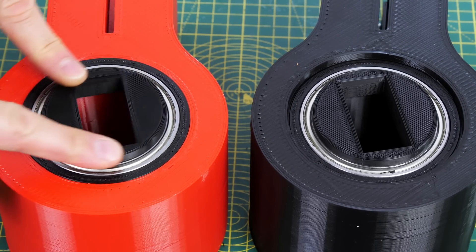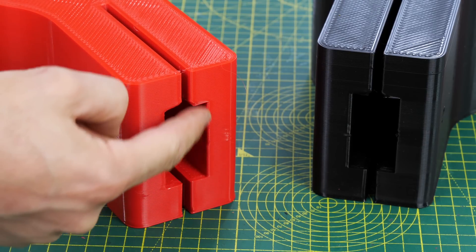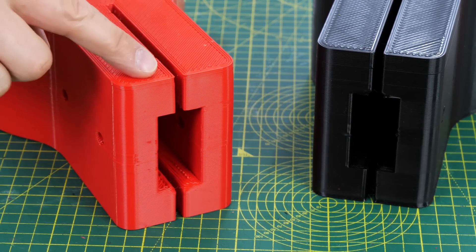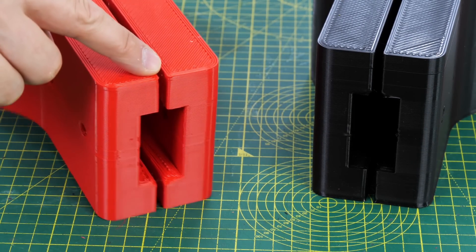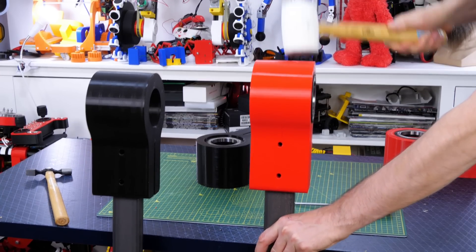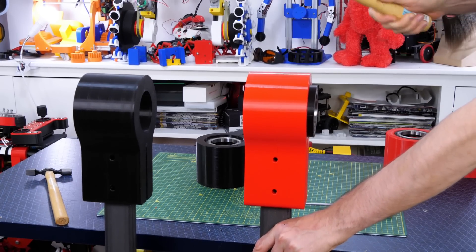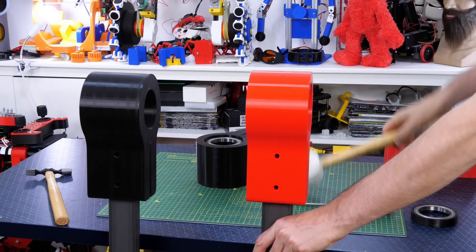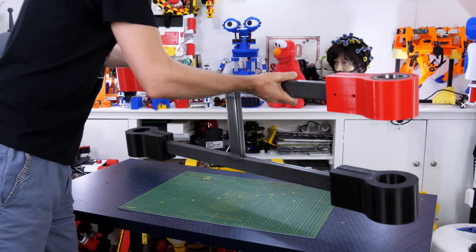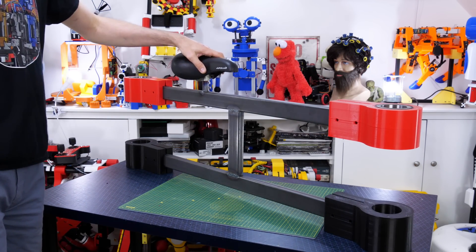In there we've got some inserts for my 50x25 steel so I can put a square axle in essentially, and we've also got the square axle shape for the rest of the frame. I've left slots in these parts so there's some flexibility and it's much easier to get them in — without that slot I'd never be able to put them on at all and get the tolerances right. There are bolt holes there but I don't think I'm going to have to use them because they're a really tight fit. So there's that frame with its four pivot points, my two steering columns, and a little stub there for the saddle.